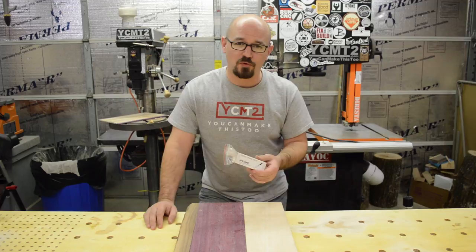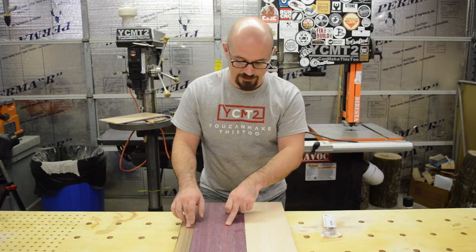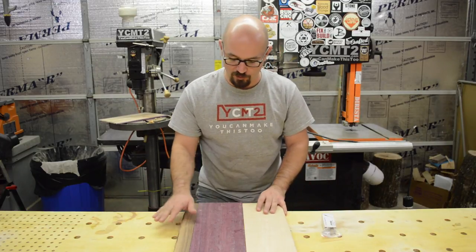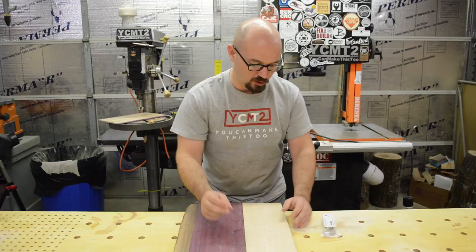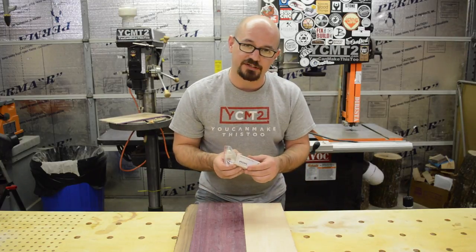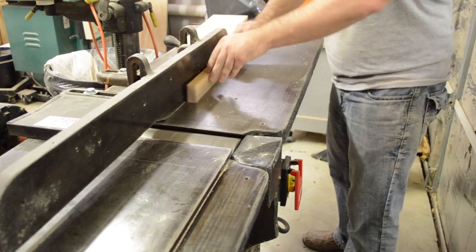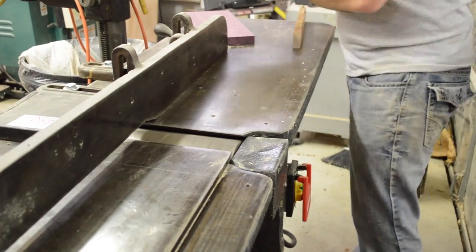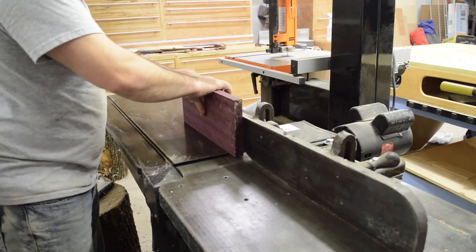To make these, I'm starting with a cheese knife kit that I ordered — there will be a link in the description — along with some off-cuts of curly maple, purple heart, and walnut. It's not a crazy design. I just need to go to the jointer, get one good clean edge, and then rip all my pieces on the table saw. I'm going to take an off-cut from this curly maple along with some of the purple heart to make the blank for the cheese knife.